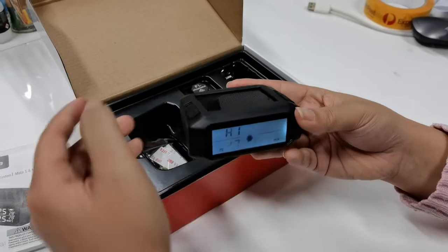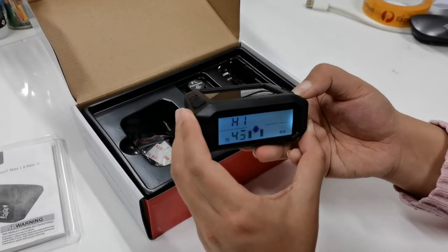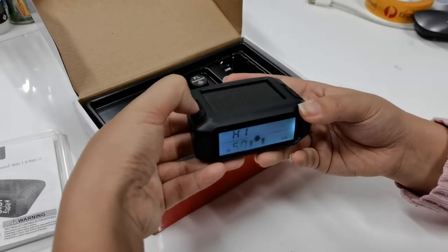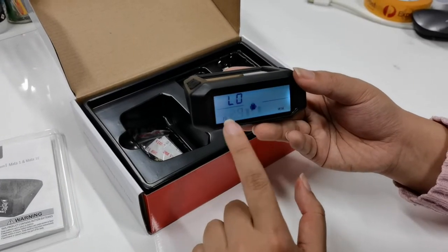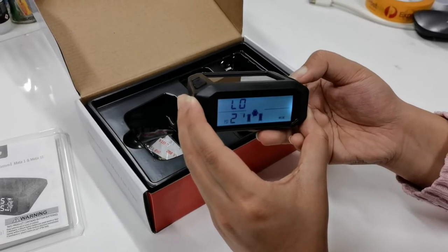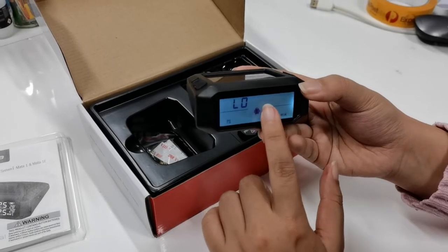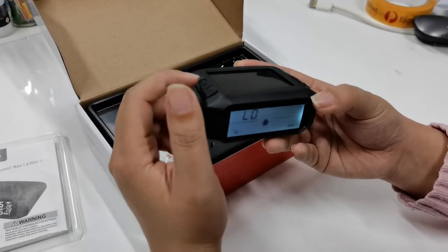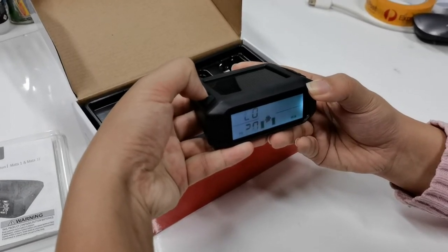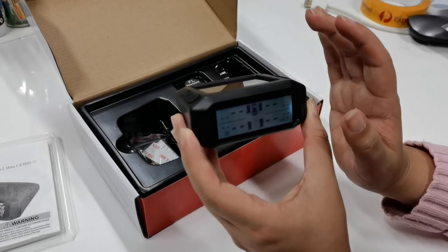Press the cog again for the trailer rear axle. Use the plus or minus button to change it to what you like, then press the cogwheel button to go to the low pressure rear axle setting. Once you're done with this last parameter, hold down the set button and keep holding it down until you hear two beeps. You should go back to the main screen, and you're done.